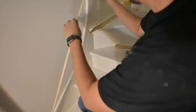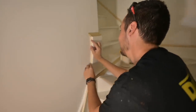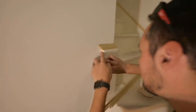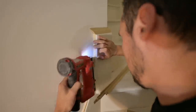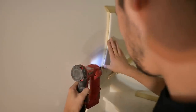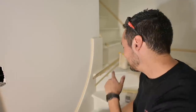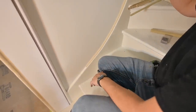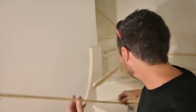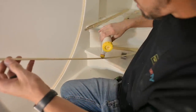People ask me why I glue stuff to painted surfaces — there's really no other reason other than it helps me sleep better at night. So 17 more to go. We're going to do the same process 17 more times, lining up our crucial point up here which is our outside miter, and not really giving too much care to the other end because that's going to be cut off. Just that same repetitive process — adding glue to each individual piece of wood and doing the lamination, getting it anchored in with pin nails.